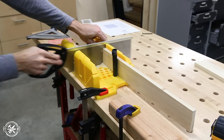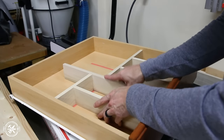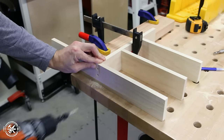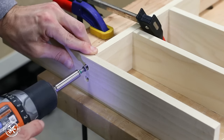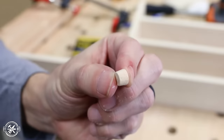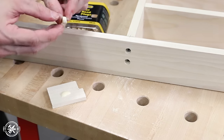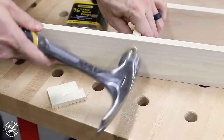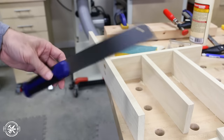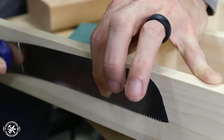I cut a long piece that would go between the large and small utensil bays, and I took them back to the drawer to mark for joinery. The key to assembling this whole organizer is doing it in the right order so that you aren't trying to fit a drill into a 3 inch opening to attach a part. On this long board, the screws are on the side and they'd be seen when it's in use, so I drilled the countersink deeper, leaving room for a plug. These are little 3/8 inch flat bottom plugs, and they fit perfectly right in that hole left by the countersink. With a dab of glue and a hammer you just fit them right in there. You could sand these flush, but a better way is to use a flush trim saw — this little guy is about $15 and has super fine teeth. It saws right through the plugs, and with a little sanding, they are perfect.